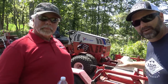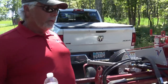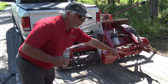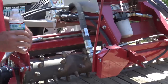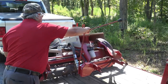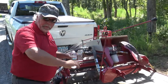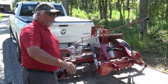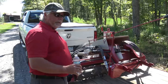This is the Ventrac power rake KP540 model. It's driven by the front PTO of the tractor and you just drive into the front hitch like with all other attachments. It has a hydraulic pump that makes it work. The nice thing is you can run it in the forward or reverse direction, making full use of every pass. If you need a perfectly smooth seedbed or gravel road, make your last pass backing up and you'll have zero wheel tracks. It's absolutely amazing at cutting, grading, and smoothing.